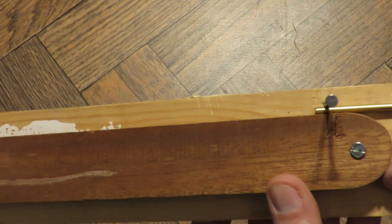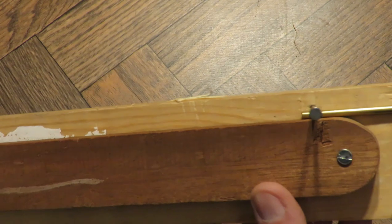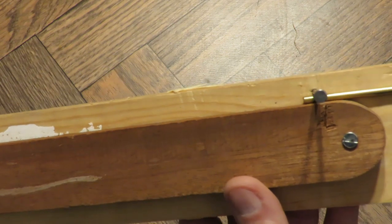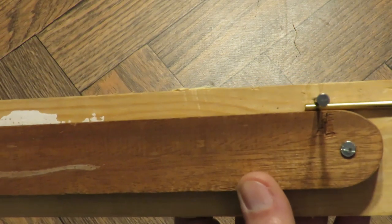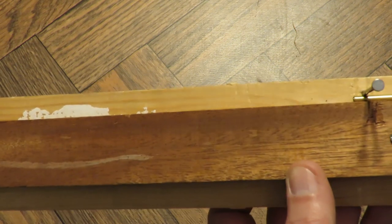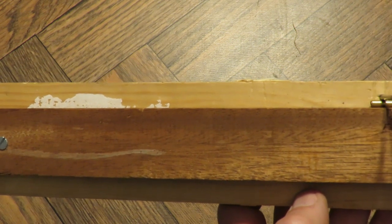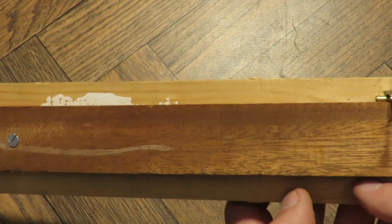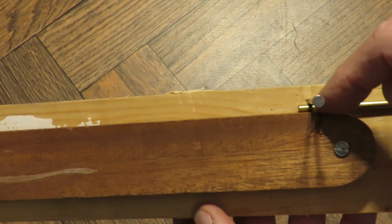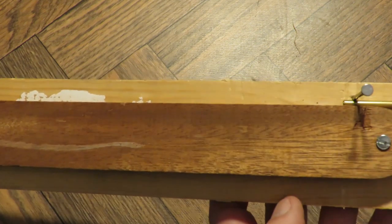And we could try cold bending it, or we could heat up the brass pipe and it should bend easier. What we don't want it to do is flatten. So I'll give it a try. I'll heat this up and see if we can bend it round in a semicircle, because that's the end that's going to go into the boiler, and the other end comes round and goes underneath the boat in the design that I'm doing. So in the boiler up there, round, under the boat, pointing backwards there.